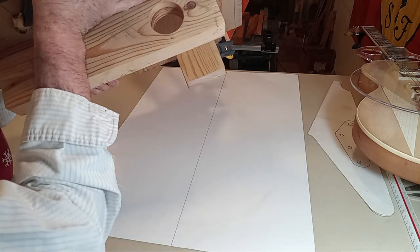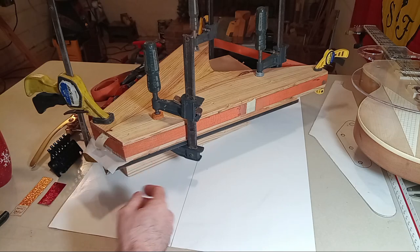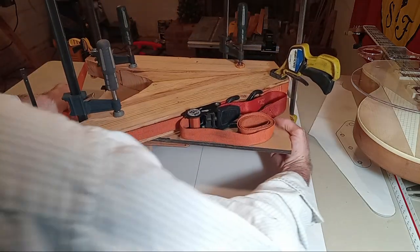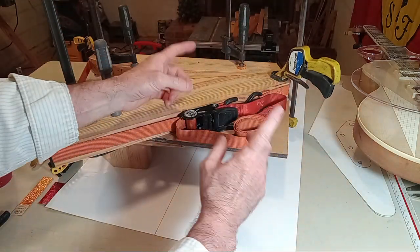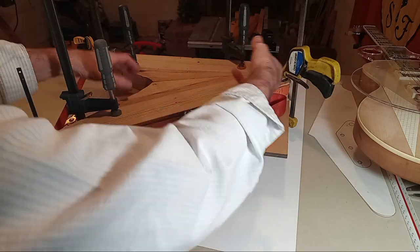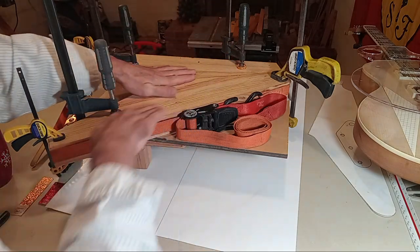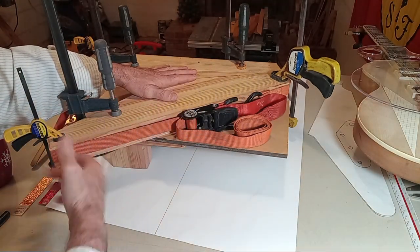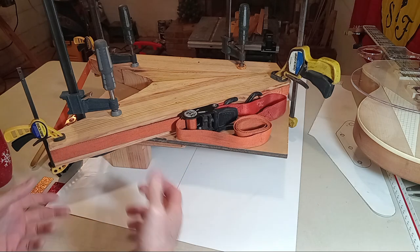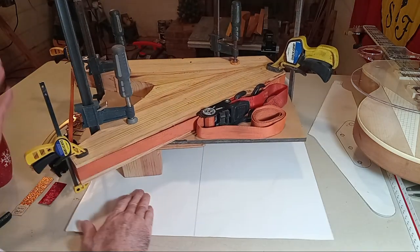Let me show you this briefly. It's just a piece of half-inch plywood with a little lift on it, and on top is a piece of three-eighths-inch acrylic. It lifts everything up and allows me to do clamping — I've got clamps with a really deep throat reach that can get in there deep and press down on a board that's being problematic. I wouldn't recommend buying a rough board because if you don't have the machinery or the knowledge to surface it, you might end up getting yourself in trouble.